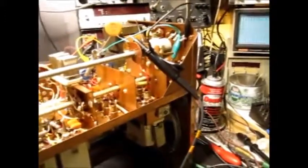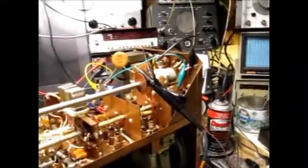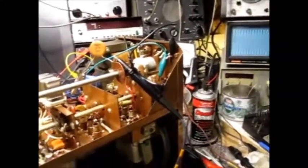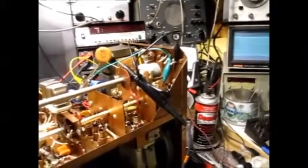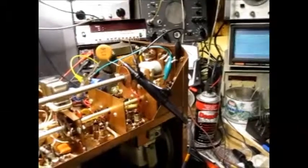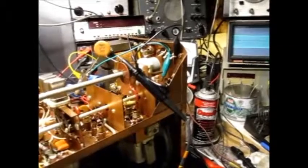So there you have it, Graham. It's all to do with this oscillator. I think the wafers both need replacing — probably replace all the components while we're at it — and that will make it reliable, because it works in all bands. That's the dodgy contact again. At least the crystal is oscillating now.